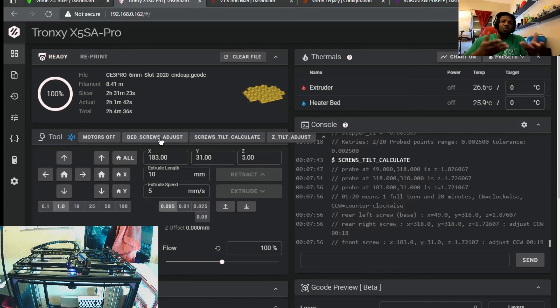Keep adjusting until you get within 0.1 or 0.2mm - usually within five or six minutes is fine, but lower is better. So that's Klipper Screw Tilt - pretty easy to set up. I hope this video was helpful and I wasn't going too fast. That's the end of the video, but there's more content coming. I have a surprise to announce soon - another printer build - so stay tuned. You guys have a good one, I'll see you in the next video!